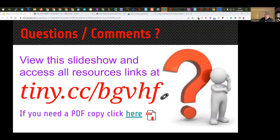Yeah, and let me just mention one very popular maker of these hotspots. They pre-program it for a frequency that happens to be the national simplex calling frequency on 70 centimeters. And I have written and called them to tell them, don't do that. What you do is, if somebody's going to buy it, you ask them to contact their frequency coordinator for that band and ask where that should be placed. And if they don't have one, they need to figure it out. But they don't want it sitting somewhere where you're going to be interfering with repeaters or interfering with normal voice simplex operation. Most coordinators have some things set aside for digital, and they may assign you one of those. But please check with your frequency coordinator before you go and place one of those things.